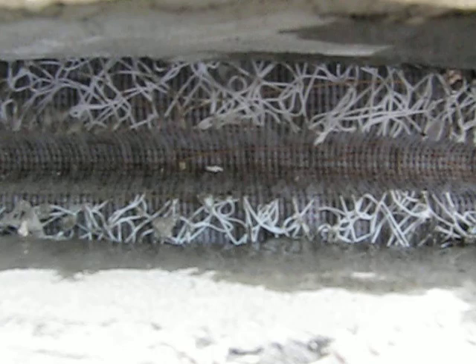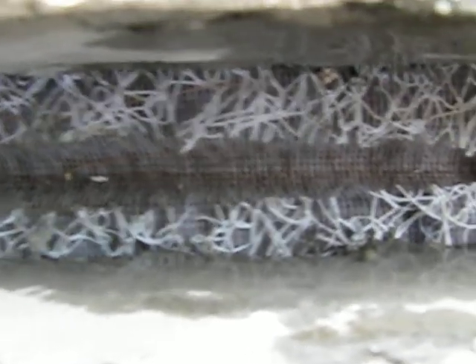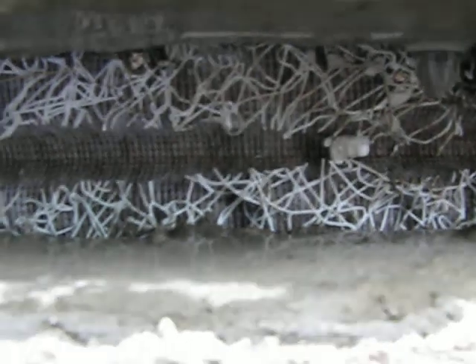The expansion joints are the critical area. You need to be able to have the drainage mat, or some other method, of transferring the water past the expansion joint — especially with the channel insulation system.